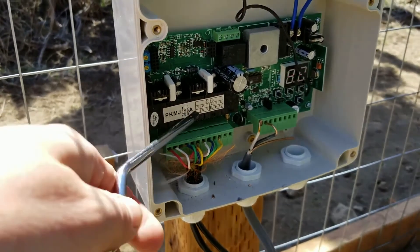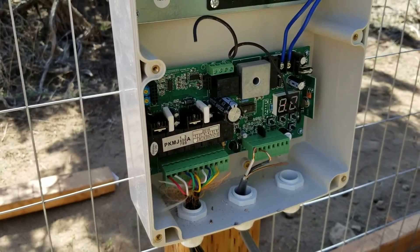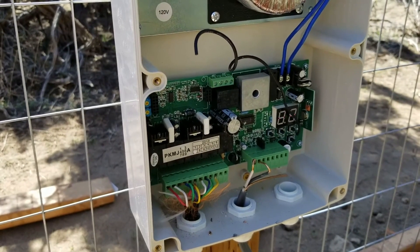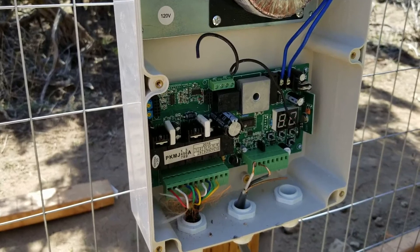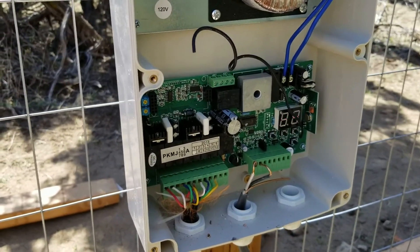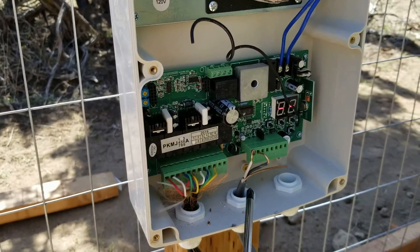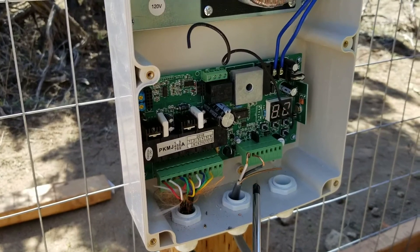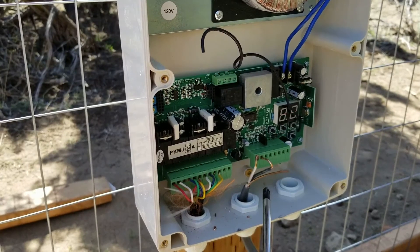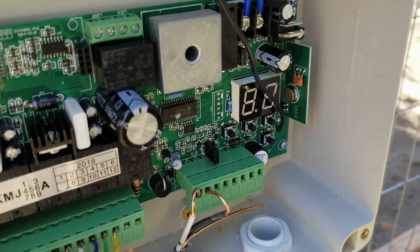It turns out you have to remove these plastic pieces before you install them — just pop them straight out, flip them over, undo the terminals to open them up, put your wires in, tighten them back down, then fold them back over and insert them. Also use a voltmeter to test the voltage you're getting off your wires here — it should be about 24 volts. If you've wired your batteries in series, you'll have 24 volts coming through and you'll know your controller is ready because the red lights will be flashing.